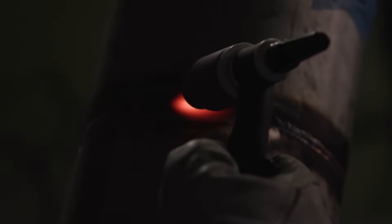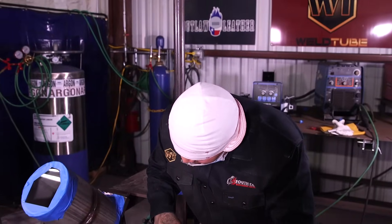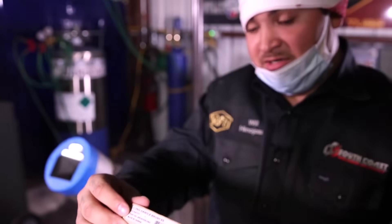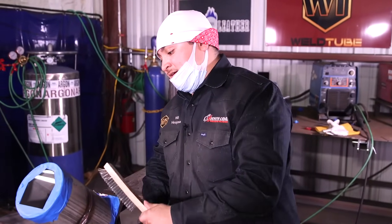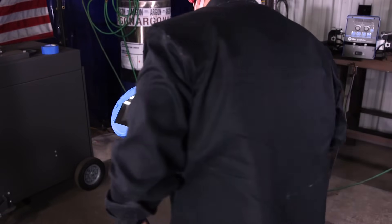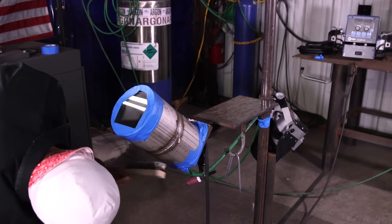Nearing my tie-in — take your time on this tie-in, let it fill up by itself, add wire, there it goes. Keep going. I'm about to close — I don't just flick off. By trailing my arc, just like that. Now I'm just going to brush out some of that color, and if I have to I'll grind down some high spots out of my root. Make sure you brush it with a stainless steel only brush — if you use a carbon brush or a wire wheel it could embed itself in that stainless and it'll rust. That is a no-no on any job.